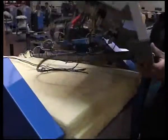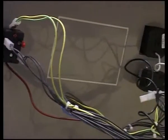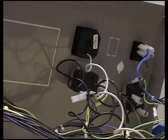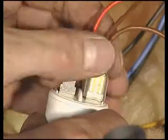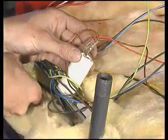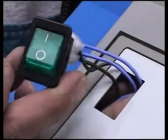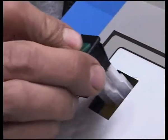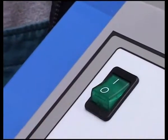When replacing or repairing any electrical component, it is necessary to remove the control panel on the boiler. Replacement of the draft ventilator capacitor is quite simple — it is attached with a nut to the connector and the wires are push-on connectors. Replacement of the switch is also not complicated: remove the connectors and push the switch out of the slot.